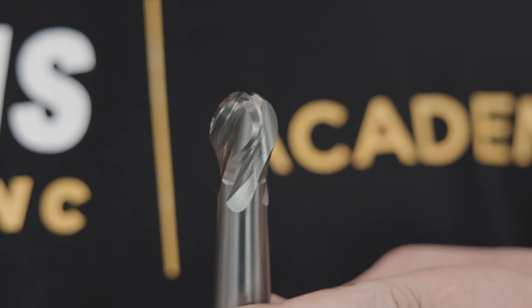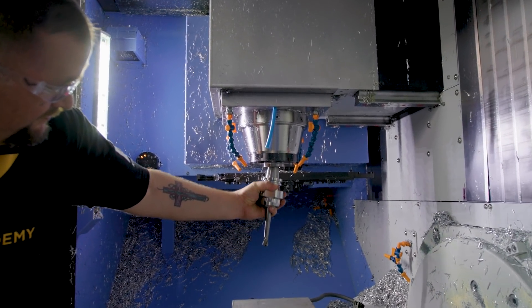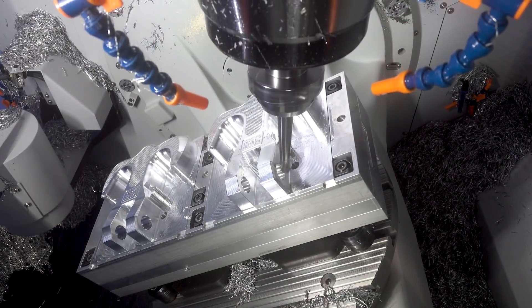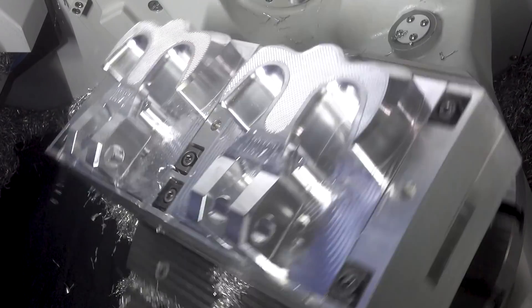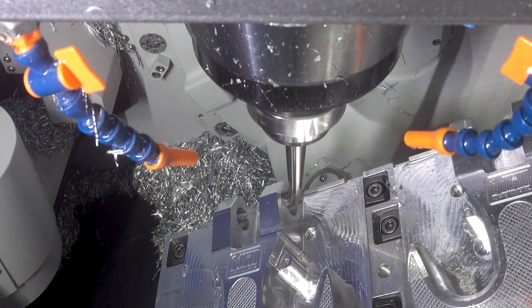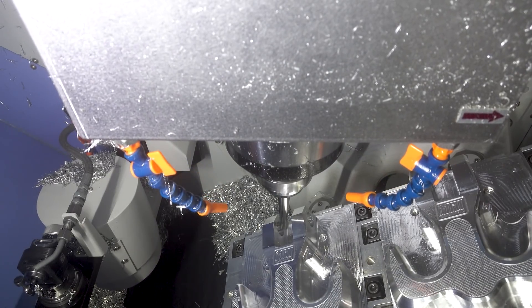Our custom tool is done. Barry's got it loaded up and ready to go in his DVF 5000, so let's go check it out and see how it performs. The goal of course is to get a part out of the machine that's a hundred percent ready to deliver to the customer without any extra operations, and we've achieved that here today with the help of our CNC grinder. Take a look at how nice and clean this tool path is — we're just making a perfect circle in 3D space.